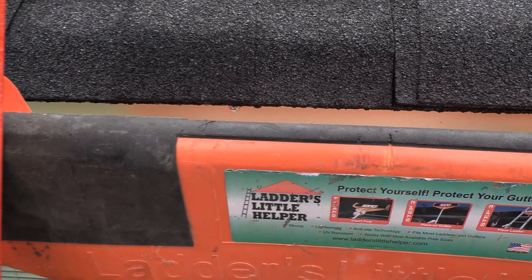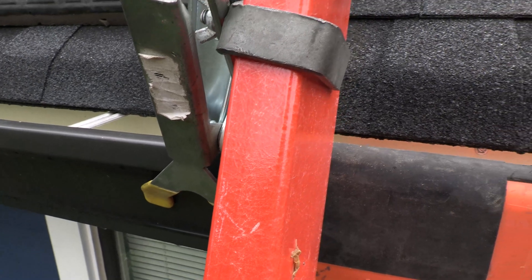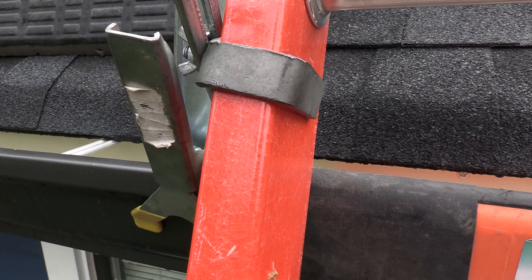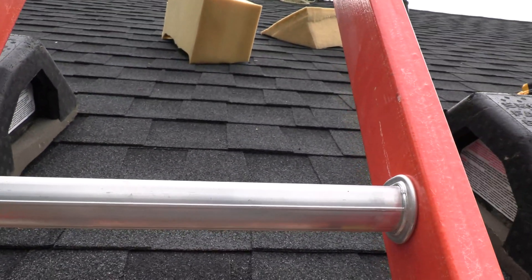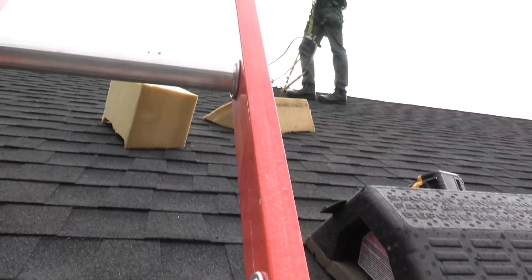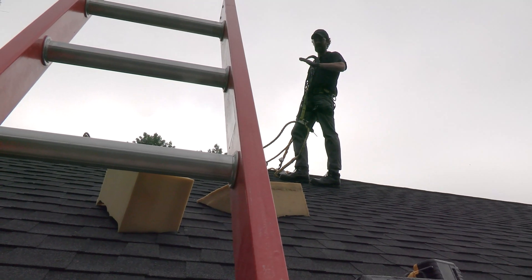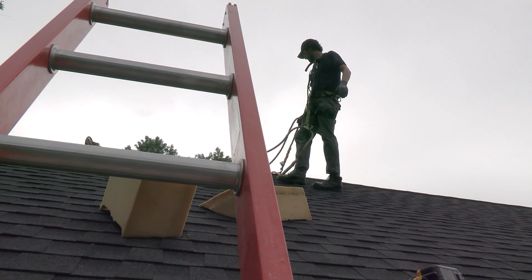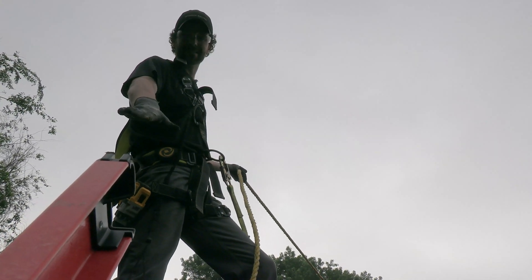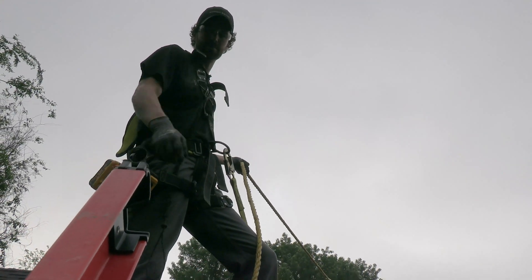You can slide down the roof, knock into that ladder, and it's going to stay right there. The number of times we're going to mount and dismount off the roof today is probably 40 or 50 — by the time you take a pee break, a lunch break, move parts, and you've got three or four guys up here and back down. You've got to secure that ladder, lock the snot out of it. Get everybody's ropes ready, everybody on a separate tie-off. Get the rope at the ladder so they clip in before they take that first step — that first step is the most dangerous.